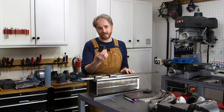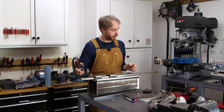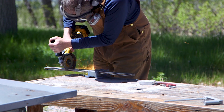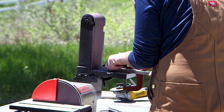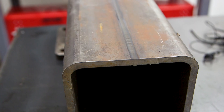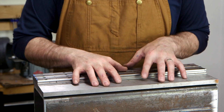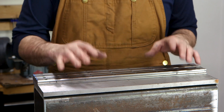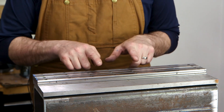I'm using some linear guide rail made by THK to carry the table and maintain its alignment. The guide rail is way too long at 28 inches, so I need to cut it down to 18. I'm using a cutoff wheel in my angle grinder to do that. Once I had it cut to length, I used a belt sander to put an even finish on the end. The 6-by-6 square tubing isn't perfectly flat, so instead of bolting the rail directly to the column, I bought a length of 6-inch by half-inch ground steel plate. This is flat and smooth and will be a really good surface for the guide rail. I'm going to mount that plate to the column and then bolt the guide rail to that plate.